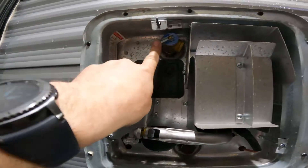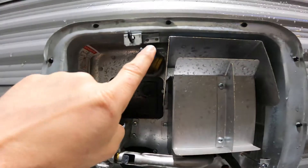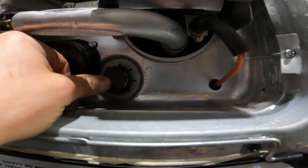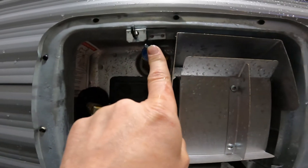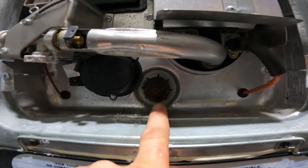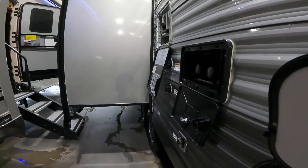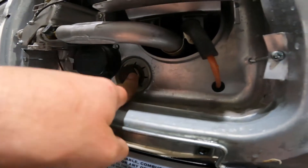We have your pressure relief valve. We should always make sure the pressure relief valve is open before removing this rod, because if the tank is pressurized and you don't relieve the pressure first, this will come shooting out of there like a rocket. Especially due to the height of this one, which for me is right at head height, that could be extremely uncomfortable.